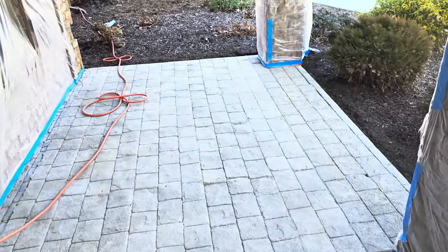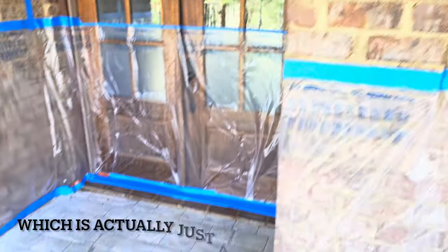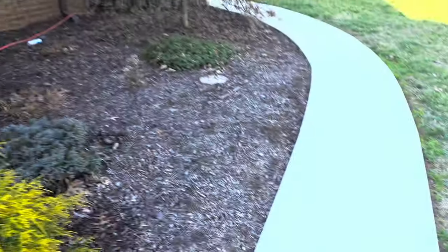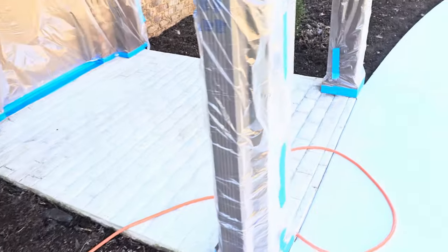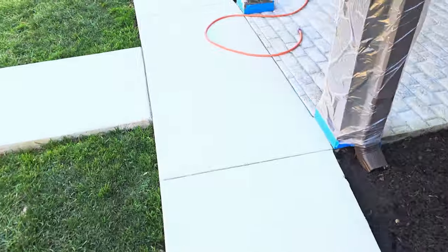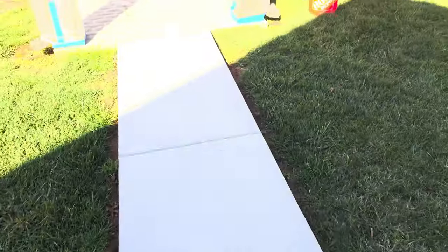What we're going to do is actually spray exterior dye — acetone dye — over this. We're going to use a sand color, which is kind of close to the grout lines. So we're going to spray that dye over this and then spray dye over this whole sidewalk. The same color will go across all of this, including the sand color on the sidewalk and these two stamp jobs over here. Once the dye is down, we'll come back and seal the broom finish sidewalk.